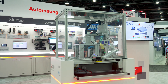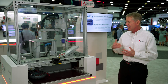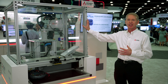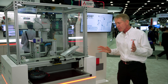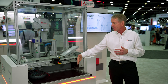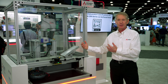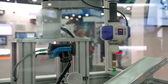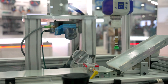In this case, we're utilizing one of the features of the SafePlus card, which is zone safety. So you can see the SICK laser scanner in front. And just because it's a trade show, we have this panel still in, but in reality you wouldn't need it. When I'm clear of the zone, it's running at full speed. But as I approach it, you can see the robot slows down, because now that I'm closer to the robot, it's not allowed to move at the same speed.